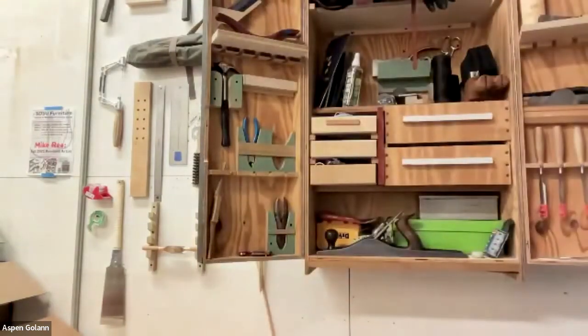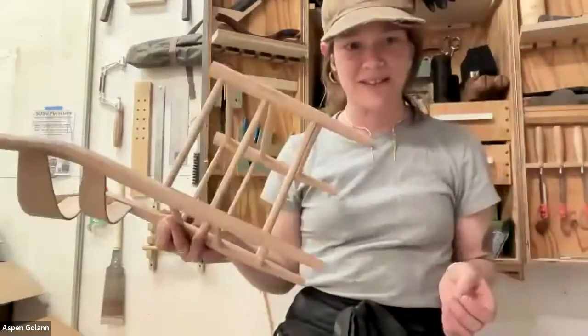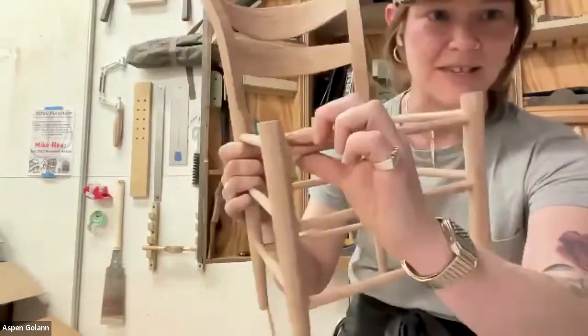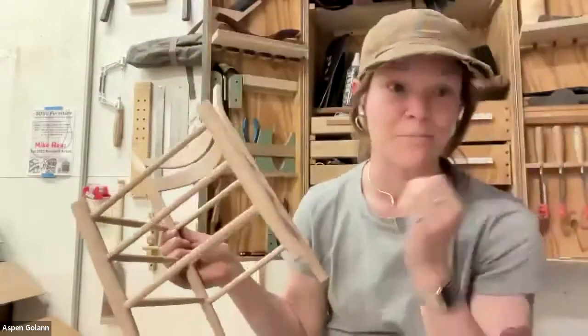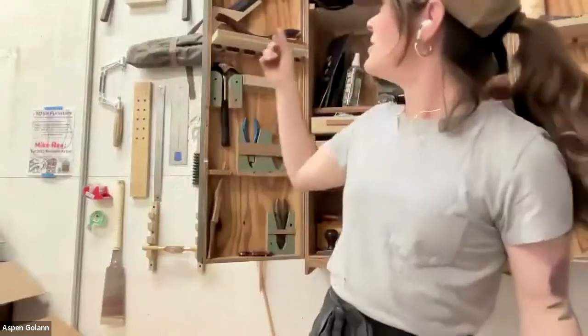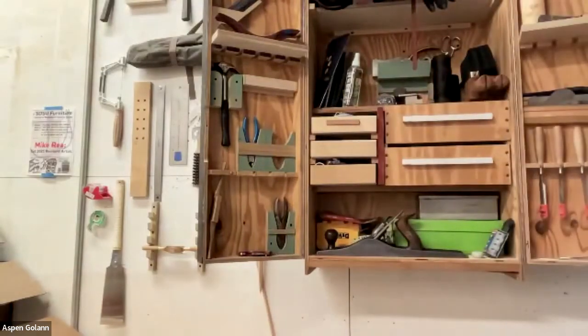Oh yeah, too, I make all my spindles by hand. Definitely. I split everything from a log and make it all by hand. It wouldn't be strong enough if you didn't. And I make mini chairs too, if I'm playing with the Jenny Alexander chair. I just made these yesterday just to see if it works. This is basically a spindle, as small as my spindles for that big green curved settee got. They're all spokeshaved. First split with the froe, then worked with a drawknife, and then brought to size and to their finished surface with the spokeshave. Occasionally with the scraper, but that makes the milk paint weird. So usually not. Milk paint adheres differently to a scraped surface than a cut surface.